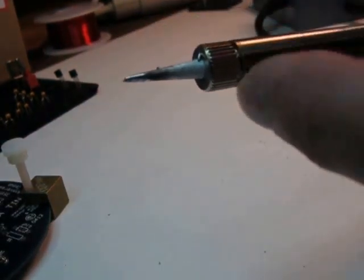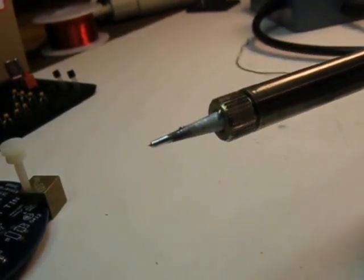Very nice. It's got a screw holder and the tips easily come out and you get all kinds of different tips for it. That's the important thing with an iron, is that you want something where you can change the tips both when they wear out and depending upon what job you have. If you're soldering connectors or cables, you want a bigger tip, you want to deliver a lot of heat to it so you'll crank up the temperature.